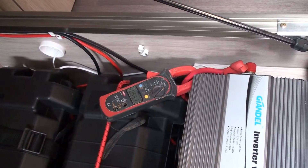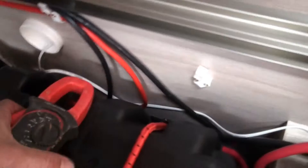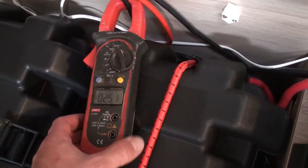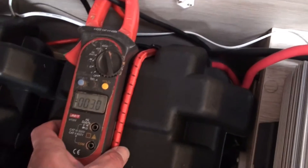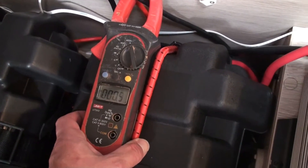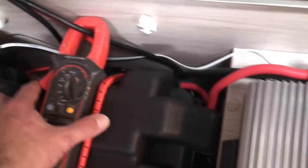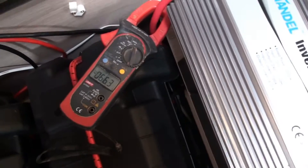The question is where are those amps coming from? That's what's coming out of the inverter. 25 of those amps are coming from the car. And this is my solar panel here — that's only about 3 amps. It is a bit overcast. I'd be keen to hear from you guys — on a sunny day, what should I be getting out of a 250 watt solar panel? I'm only getting 3 amps today. And it's pulling 65 amps, so it's really cranking the juice.